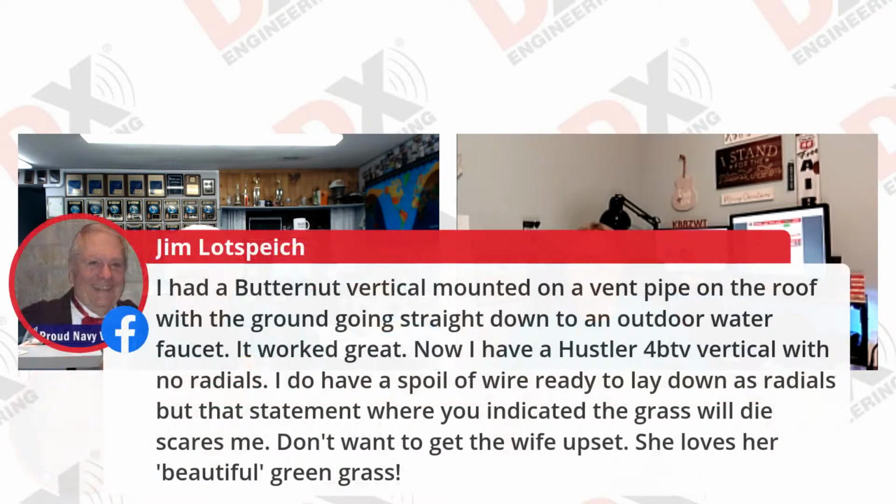And Jim says, I had a Butternut vertical mounted on a vent pipe on the roof with the ground going straight down to an outdoor water faucet. It worked great. Now I have a Hustler 4-BTV vertical with no radials. I do have a spool of wire ready to lay down the radials, but the statement where you indicated the grass will die scares me.